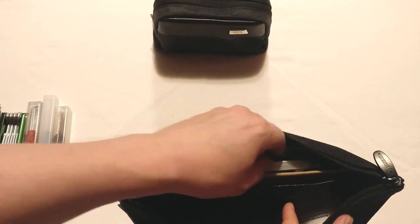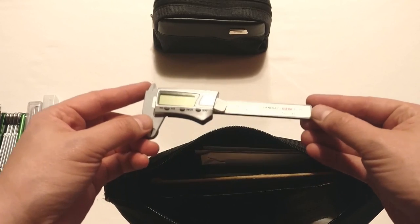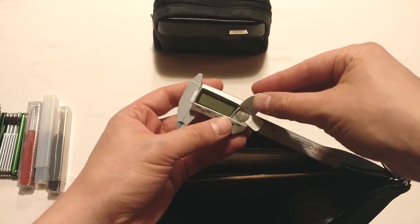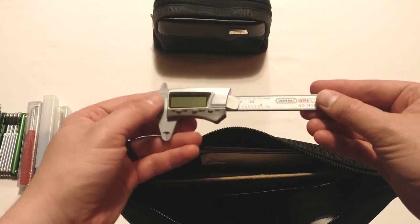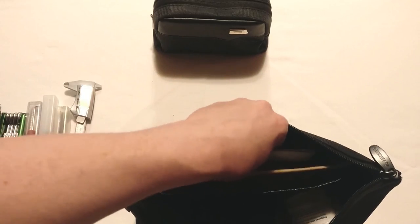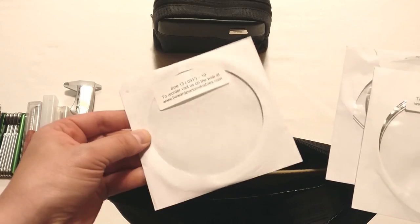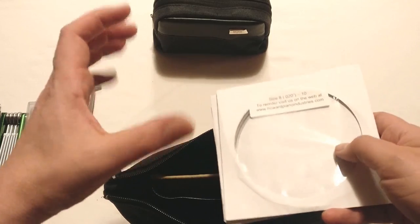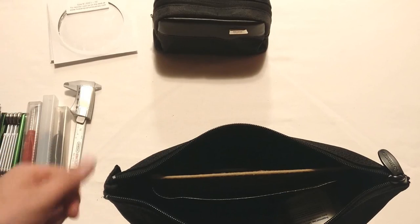Let's go over to this side pocket, starting with a set of calipers. The cheapest one available on Amazon, the UltraTech General Tools, with a little flap of paper in the battery slot just because this gets mashed around, beat up, banged around in my bag. It doesn't matter if those buttons get pressed, it's not turning on. And if it gets so mashed around that it's broken, I'm out 20 bucks. Piano wire, from the two super tiny number 8s and 9s up to a 13 for a little more heft. You'll see us inserting this back behind door latches, especially if there's a long guard plate, something that you can't reach. Having a little extra piano wire as a bypass aid is very helpful.